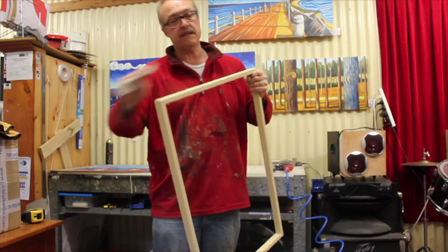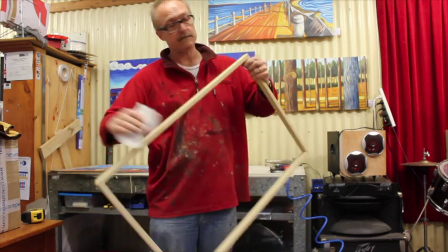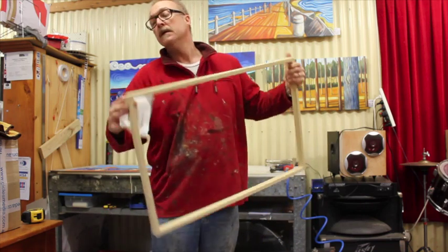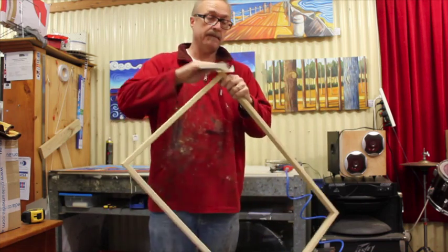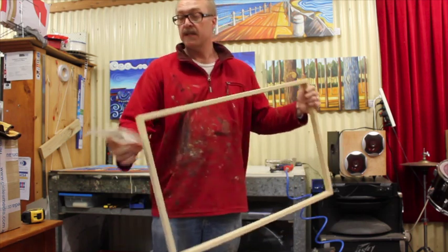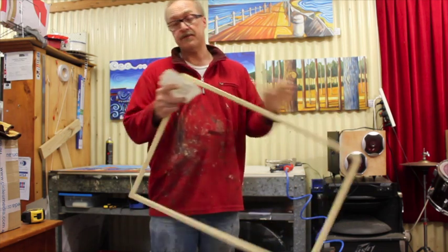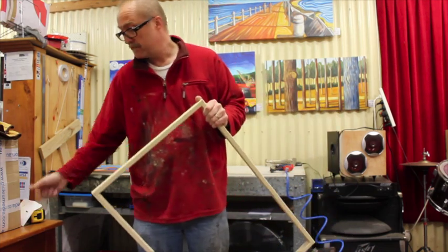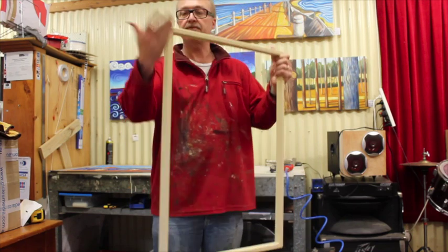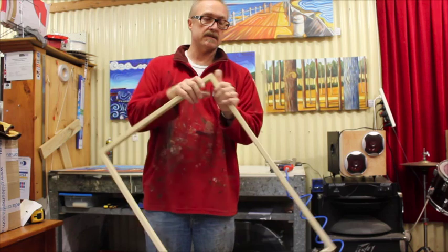You'll notice the timber I use for this frame is actually primed — they have already been painted. They don't have to be primed; it just happens to be the timber that I use. It's good because it's pretty resilient to moisture and temperature changes. So there's a light sand — you don't have to sand it beautifully, just until it starts to feel smooth and you can't feel any rough hairiness along the edge.